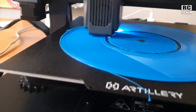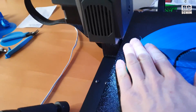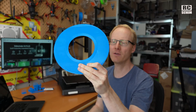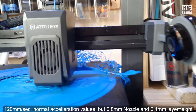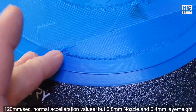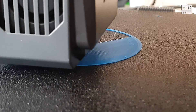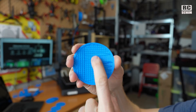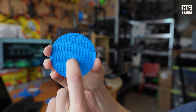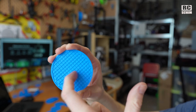It took me three attempts until the layer adhesion and everything worked. I was still on the 0.4mm nozzle with 0.2mm layer height, which prints forever on the large printer. It started good then had problems in the back. Looking at the edges on the simple little test everything worked fine, but the second layer was loose because the temperature was too low — which ruins your larger prints very easily. Once I increased the temperature to 225 degrees on this Creality PLA, the third and fourth layers all stick quite well.